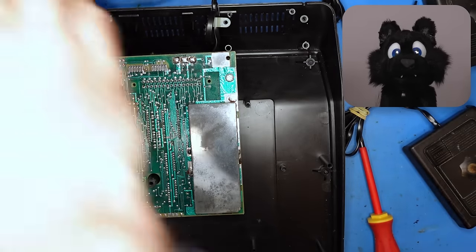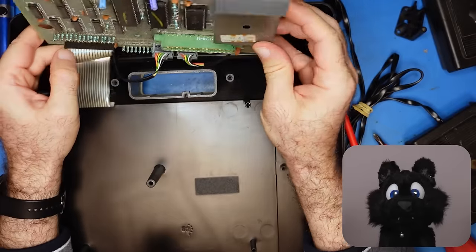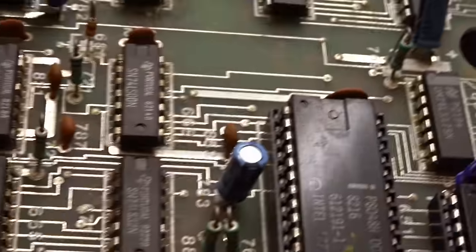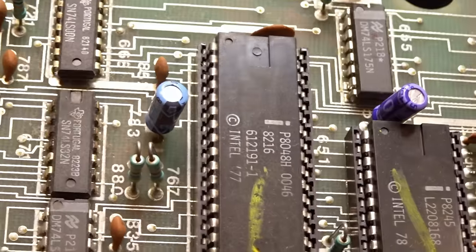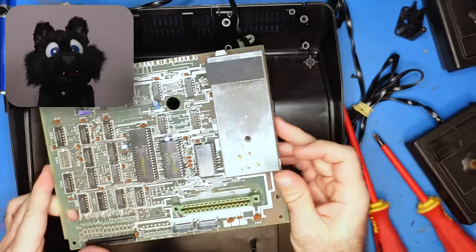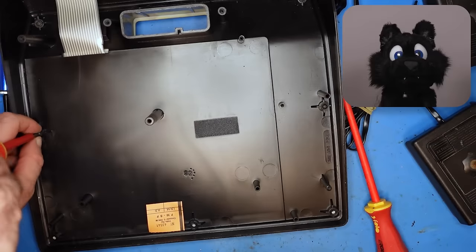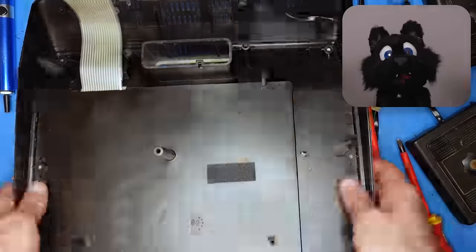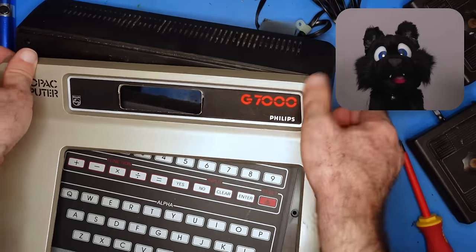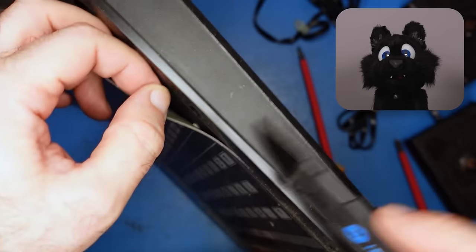The keyboard has one of those very feeble flexible PCBs and all the contacts look extremely corroded. Checking up on the general layout, this PCB is not the one from my schematic. Undoing the screws for the silver keyboard bezel next — the angled part makes it hard to pull apart. The keyboard was held in place with the bezel on the outside but was glued down with double-sided tape in the middle. A bit of careful poking later, it's off.